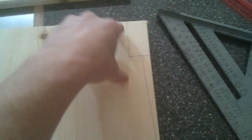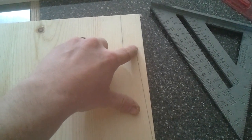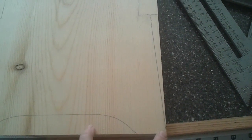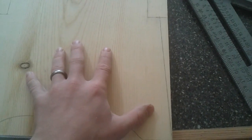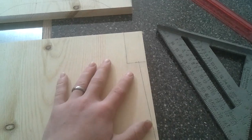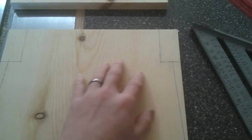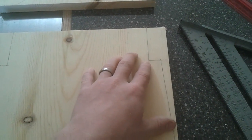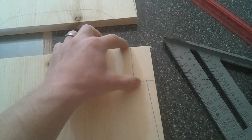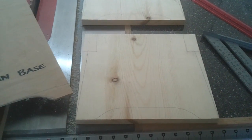That's where my pieces are going to be. I want the half-inch overhang, so I came in a half inch and I'm going to taper this back down to the corner of the base. That way the base is as wide as it can be from the material I'm given, and this will allow me to have a half-inch overhang — just dresses it up a little bit. I've never done this before; this is all just something I thought about yesterday and figured I'd throw together today. My thickness is three-quarter material, with a two-and-a-half-inch rise for the side supports.